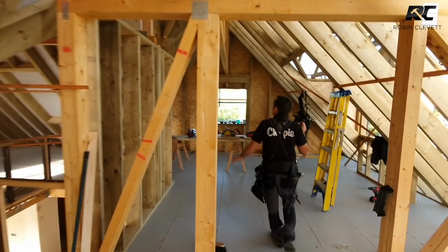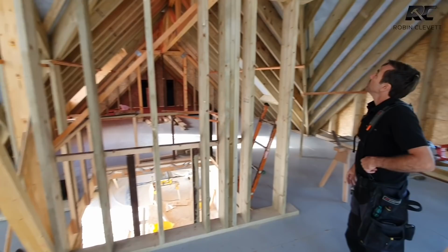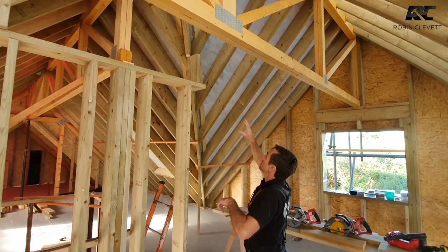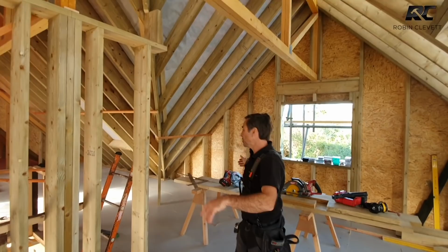And we've also got this load-bearing stud partition here, which travels from the end of the lattice truss all the way down, again, over the big load-bearing wall underneath. And we're just about to tidy the ends of it up, add a couple of little posts underneath our scarf-jointed valleys there, which is going to be lovely because it's reducing the span of the valley and equally it's picking up that lovely joint there as well. And gives us a really nice triangulation where these valleys meet the ridge and the lower, or the narrower, section of building.